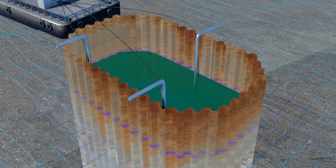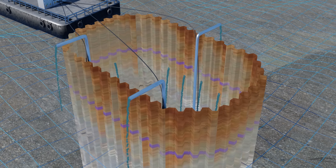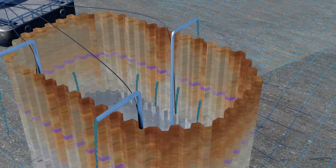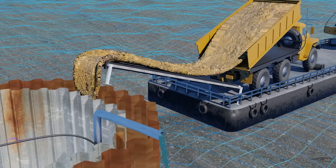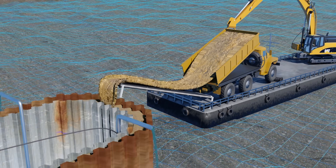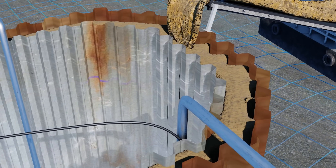Now let's jump back to the project and begin pumping water out. As the water level lowers, you'll notice water leakage between the sheet piles due to differential water pressure. Single-layer sheet piles are failing, so we need to double them. The space between these walls of sheet piles is generally filled with granular material such as sand, gravel, or broken rock. This double-layered cofferdam will effectively resist water leakage between the sheets.